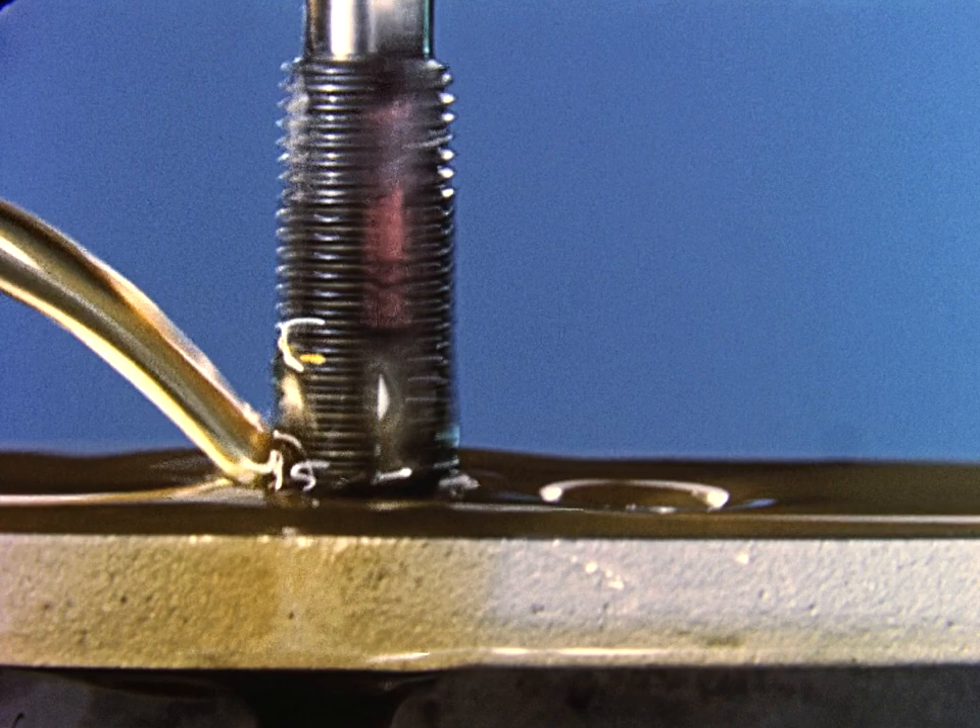Gauging the hole demonstrates the results — no screw can be made to fit that hole properly. Here is a tap correctly selected for cutting the material and with proper surface treatment, properly set up on a good machine. It is operating at a tremendous rate — temporarily, that is — because the machine was running too fast for conditions. Alignment is perfect all the way from spindle to drilled hole. The tap is correct for the material and so is the speed, but the coolant isn't getting to the cutting point. Look at the tap smoke. Another common tapping trouble is improper hole size. The hole size should be such that the tap teeth cut to about 75% of their basic thread depth.